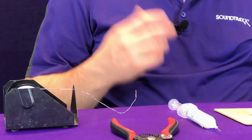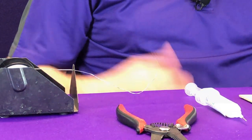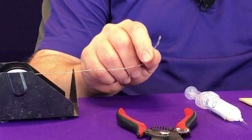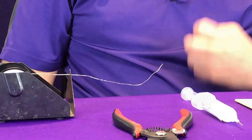The other thing you want to make sure is that you have a fine diameter solder that you can use. Now this can be rosin core or not, leaded or lead-free. Either type is fine because the biggest key is to make sure it's a small diameter, because you can always add more solder to it but it's harder to take it away.